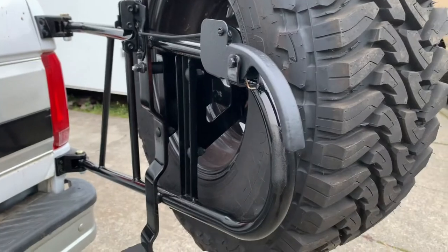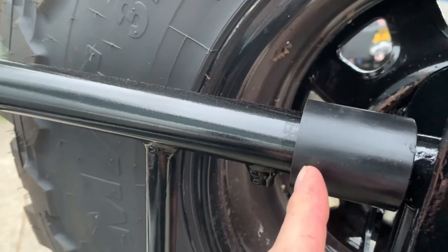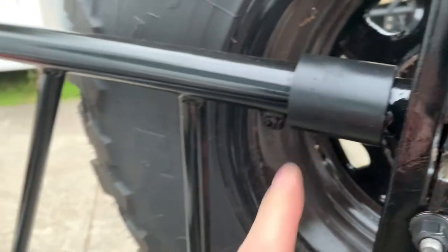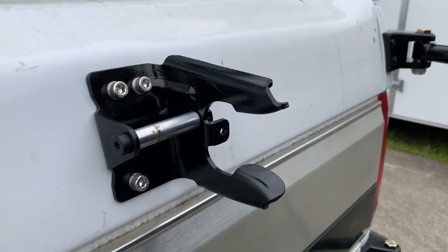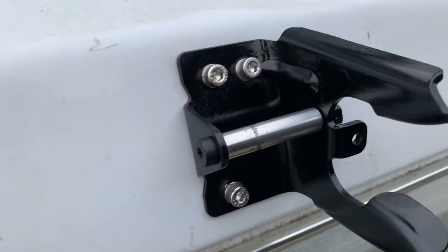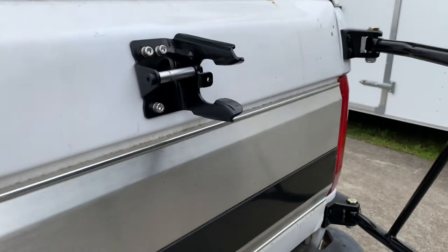The whole assembly is just night and day different. Also, the striker bushing is an Energy Suspension part — I'll put a link to that in the description as well. That takes up the clearance between your catch, which eliminates all the rattling. Then I went ahead and machined a little aluminum collar to replace the plastic one that had long since failed.